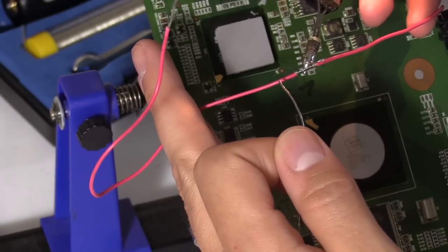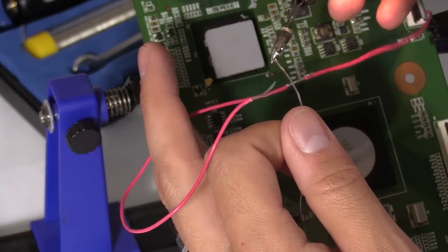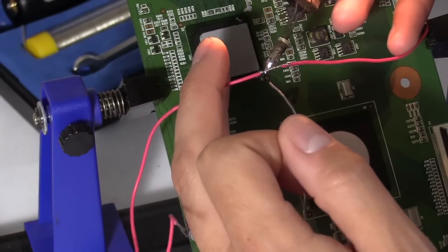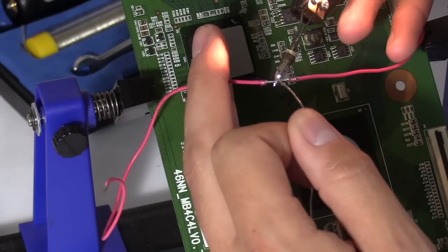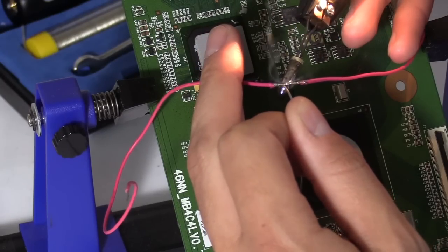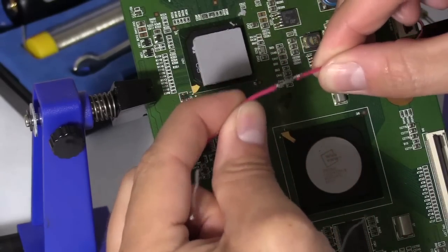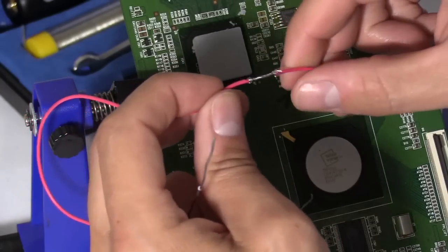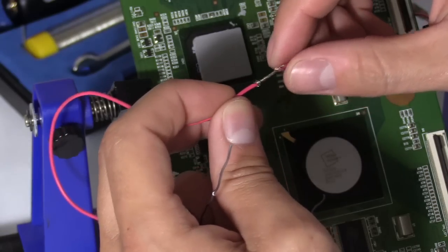So whatever you're doing, always heat up the solder joint or the wiring before applying the solder. You don't put the solder on the soldering iron and then apply it. That's not going to work. You want to heat up the wiring first and then apply the solder. Look at that, it's soaking in. Go across the whole thing and let it cool down. And then you got your strong connection right there. You want to make sure you cover this connection with an insulator like black electric tape or even heat shrink tube.